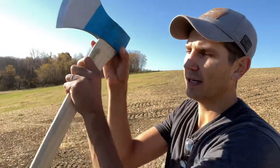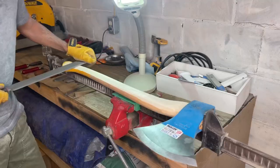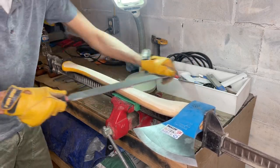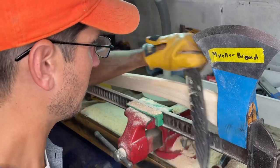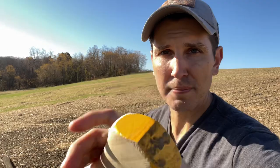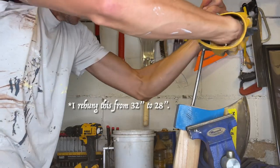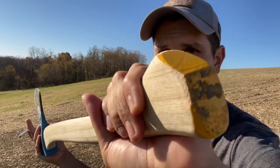As for the handle, I left it pretty wide — more in the racing style. I do have to deal with the palm swell; it's a little bit too big for me. I'm going to sweep it down this way some more. I don't mind a big palm swell on a heavy axe, but this head is like three pounds. Don't need it to be that big — it means I end up holding up here and I'd rather be able to get the full length out of it.